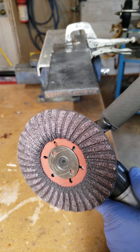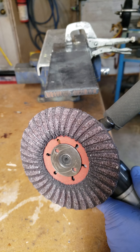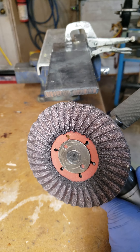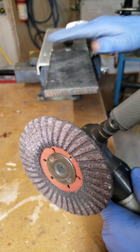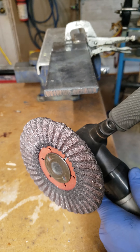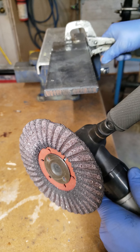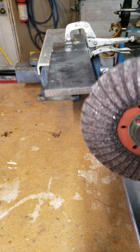Anyway, the key to doing this is go as flat as you can. Don't try to gouge, keep moving, and it'll just pick the scale right off like the other video mentioned and leave you with a finish. You still have to do a secondary operation with a higher grit fiber disc, a flap disc, or even a non-woven abrasive like a roll-lock type Scotch-Brite disc.